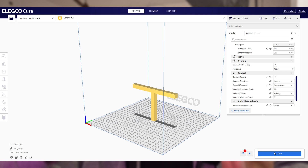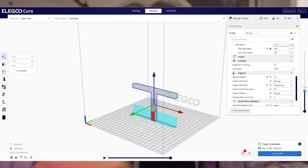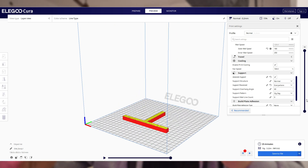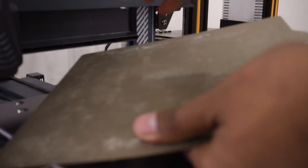It's not just about strength — it's also about print quality. Having a good understanding of print orientation means knowing how to place your object on the build plate to require minimal support, because support leaves marks on your print and that doesn't look good. The more you print, the more you understand orientation — you'll find ways to make parts look better, use less material, and require less support.